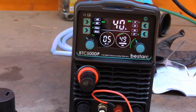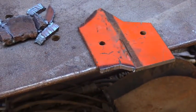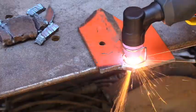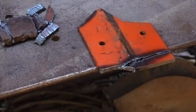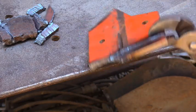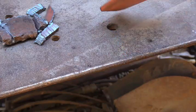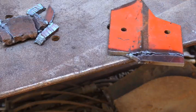I have 40 amps and 40 PSI set — I'm going to cut some quarter inch and see how that setting goes. Kind of rough right there — yeah, that's a little on the low side. I had to go really slow. I was cutting all the way through for most of it but it went a little faster in one spot. Yeah, it's a little rough, especially where I had some weld, but it does cut.